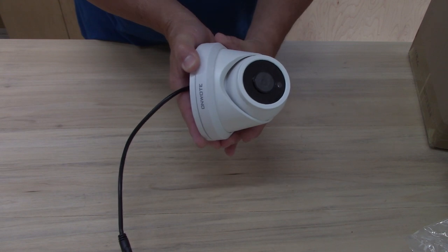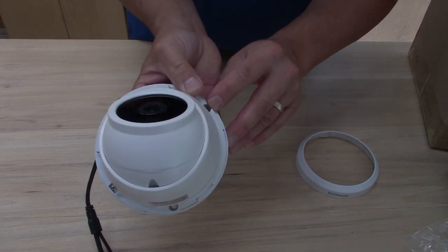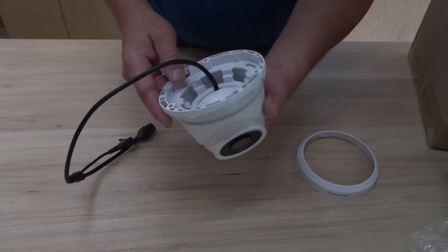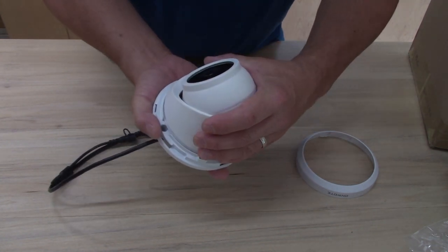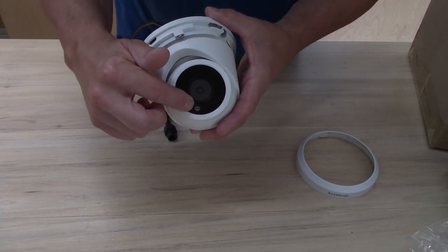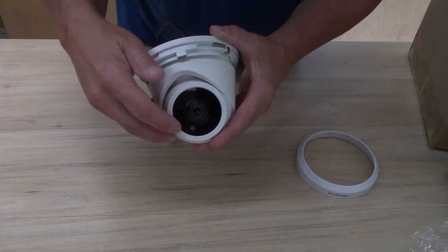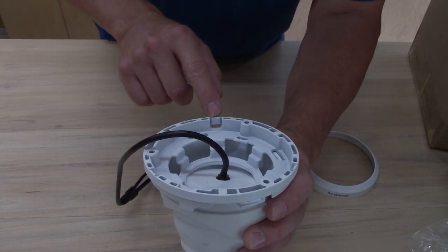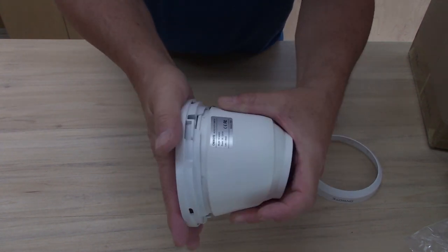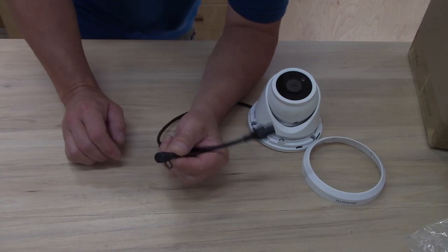The cameras are super easy to install. Take the trim ring, twist it counterclockwise and it comes off. You have a few holes around the edge — there are three of them — and you can screw this either directly to the wall or mount it facing down to the framing on your overhangs. There's also a small silver screw that you loosen to let you twist, pivot, and turn the camera however you want. When looking at the face of the camera, you'll see a small circle — that's the bottom of your picture, so orient the camera accordingly. On the back of the housing there are spots where you can snap off a piece with pliers and put the wire in, so you're not pinching it when screwed to the wall.